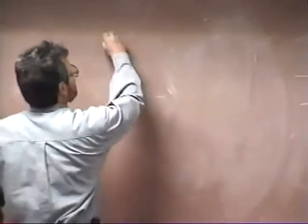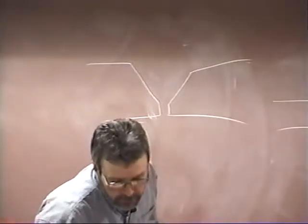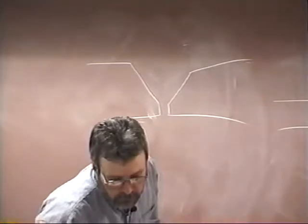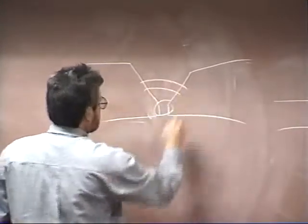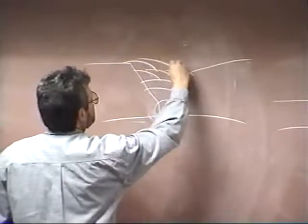Filler passes that are deposited on heavy wall pipes used in cross-country pipelines are welded by using stringer bead sequences instead of a weave, because the weave would get too large. On the next page, the diagram shows that the first three passes are single layer deposits, each extending across the bevel. The second diagram shows all of the completed sequences. So if you flip the page, you'll see that what we have is a single V-joint. The first three passes, 1, 2, 3, fill the entire joint, and thereafter he's had to go to stringer beads to fill the remainder of the joint.